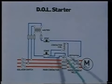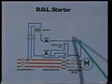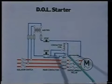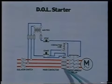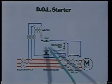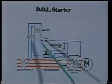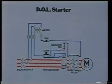At the same time, a normally open auxiliary contact is made, providing a retaining circuit for the contactor when the start button is released. The closing coil circuitry will now remain closed until the stop button or the overcurrent relay interrupts it. At this point, the main contacts are pulled apart by a spring in the contactor. The closing coil circuitry of the contactor is fed by a step-down transformer, providing a 110-volt supply.